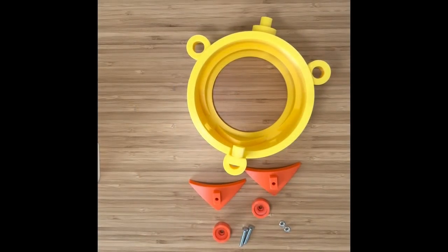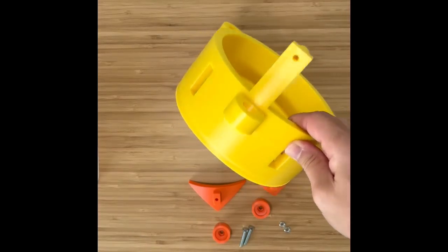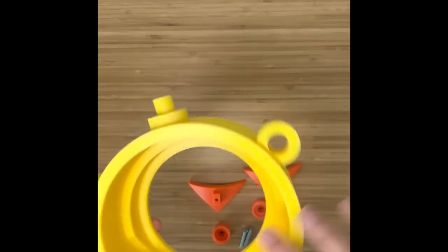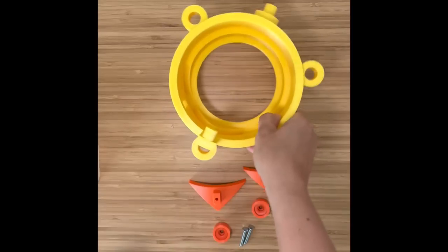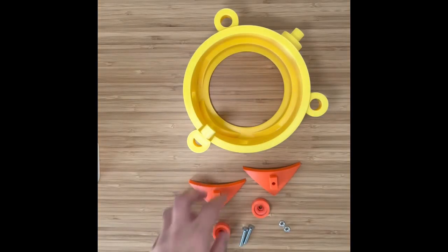Now that we have all our fasteners and our pieces made for the 3D printed sock machine, we can start assembling. We're going to start with the casing. This is what all of the pieces of this 3D sock machine tend to be built off of, and so we're going to need that to start. We're going to make the sliders attached to this body in a way that allows them to be adjusted so that you can change the stitch depth on your stitches as you're knitting. I'm going to be using those M5 25mm bolts with their nuts in order to attach them to the machine.